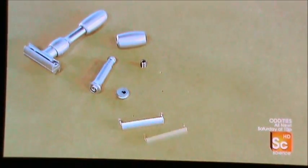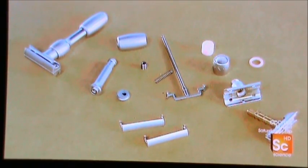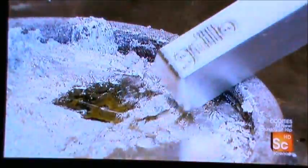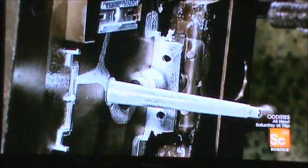Also known as the twist-to-open razor, this grooming tool is anything but simple — it's comprised of about 20 parts. Production begins with solid zinc bars; they melt down the bars in a big cauldron. The machine then presses the melted zinc into a mold of three razor parts; the zinc instantly cools and solidifies into the shape of the parts.